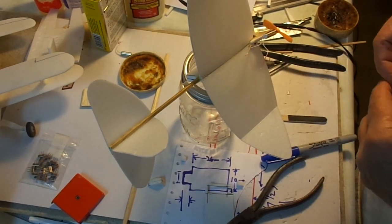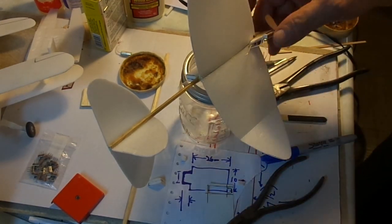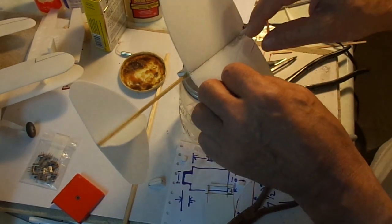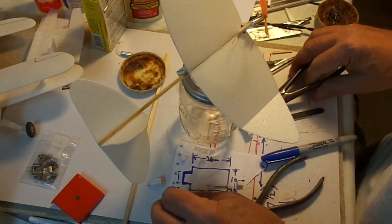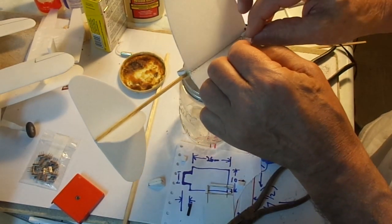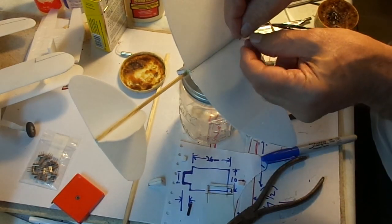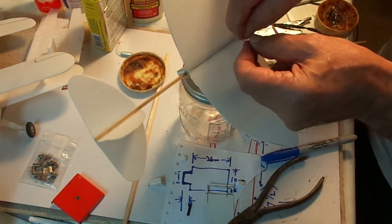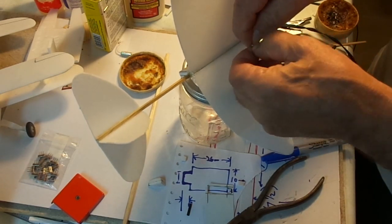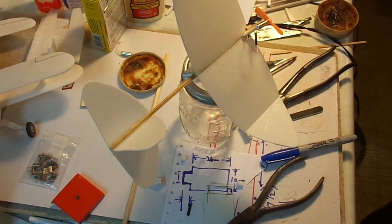And I think I will preload this with a little piece of heat shrink tubing. No, actually, let's see. Yes, I will. Just in case it ends up next to another bare piece down there. I don't think it will, but okay, so we put that one on where it's out of the way, won't get any heat on it. And then I'm going to do a splice here, twist these ends together. Oh, I caught it on the first one that time. That's nice. Wow, I don't believe it. I got it. All right.